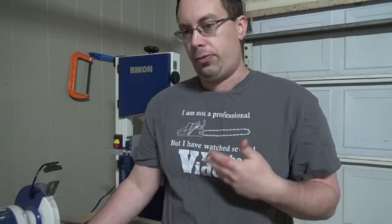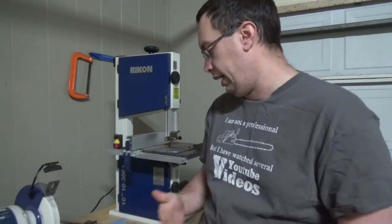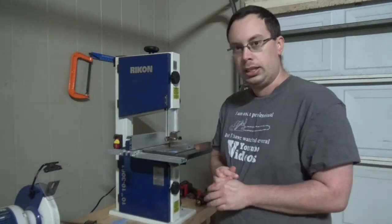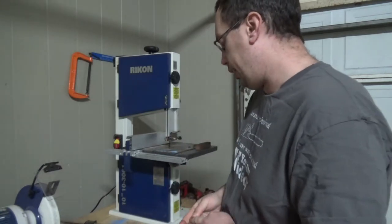We're also going to need some finishing touches, and you have the option of different ones. But for this, we are going to go with CA glue. Now you can use thick glue, which is mainly used to put the barrels into the blanks. But you really need, at the minimum, a medium and a thin CA glue finish. And that'll give it a glossy look. And of course, you're going to need sandpaper. We're going to use the sandpaper as well as the micro mesh. So we're going to go ahead and get started here.